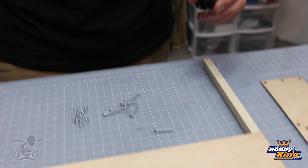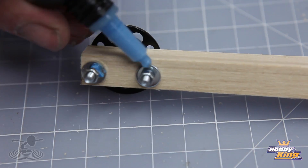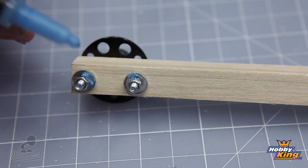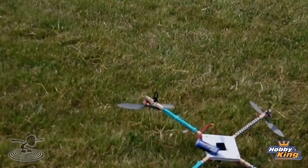The first step for electronics is putting the motor mounts on. When you put your motor mounts on, orient the Allen screws perpendicular to the boom — if you put them horizontal, it's going to be really hard to adjust the back Allen key to lock in your motor. Also use Loctite on your motors. If you watch the simple quad episode, you saw I lost a motor on takeoff during maiden — you don't want that. And if you're carrying FPV equipment, you don't want the quad tumbling out of the air because you forgot a drop of Loctite.